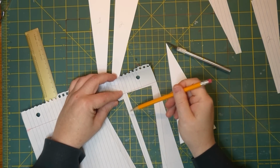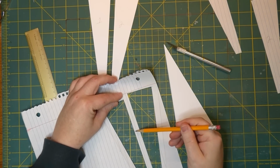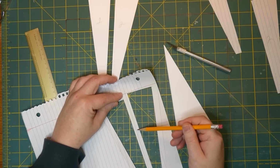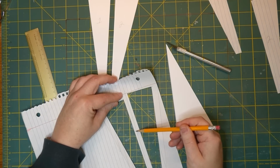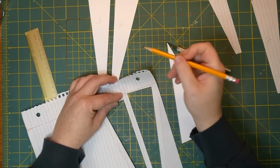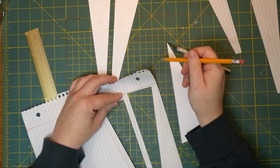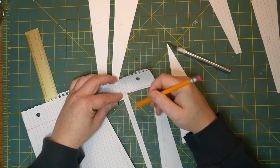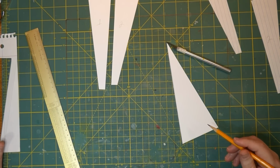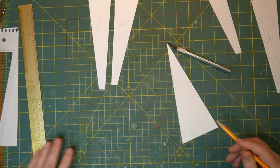So what I can do with that piece in the center is just measure this out and probably cut it off about a 1/16 or maybe an 1/8 inch smaller than this is, because you want this centerpiece to lie between the spike head details in the rails, and then that'll sit nice and flat and be just below surface like everything else.